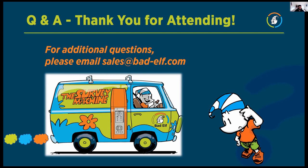With a very comparable suite of functionality. One thing I will tangent off of this that I actually forgot to mention to Dave, for anybody who's doing, you know, I was thinking of the survey marker update. On top of the ability to use an RTK, there's a function in Global Mapper Mobile that allows you to essentially GPS average a point. So you could sit and average a location over time, maybe a bit redundant with the RTK, but if you're not in RTK mode or extreme mode, I guess you guys call it, certainly something that could be useful to you. That's great. Thank you, Jeff.